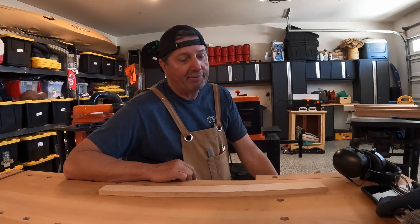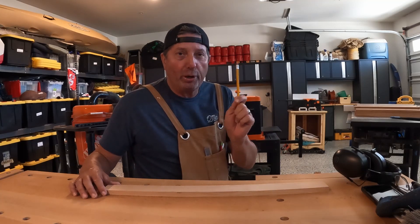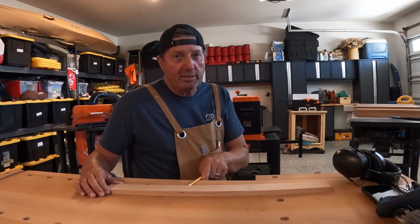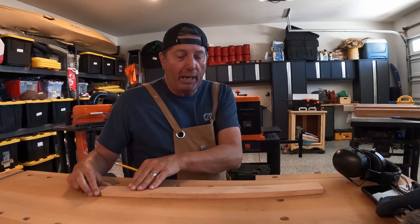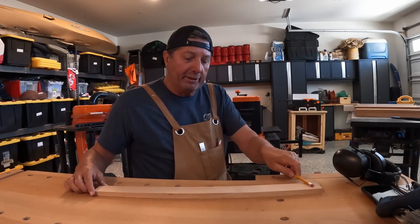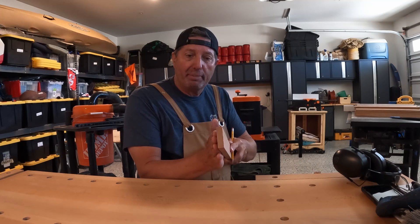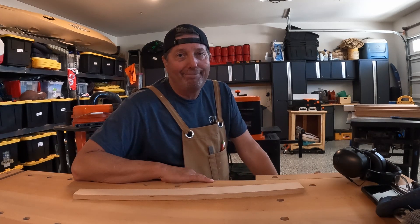Perfect practice makes perfect, so you have to do it right for it to come out right. What the planer does is it perfectly transfers what's on the bottom of the board to the top. If the bottom of the board isn't square and flat, the top won't be either. Getting it flat on the jointer was the first step; now we run it through the planer and it takes just enough off so the top is square. This is really important because when we glue these things together you want them perfectly square and flat so they butt up against each other — otherwise you'll have gaps. So the next step is running all the boards through the planer to get the top and bottom square.